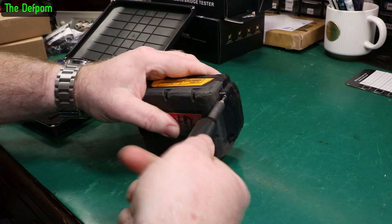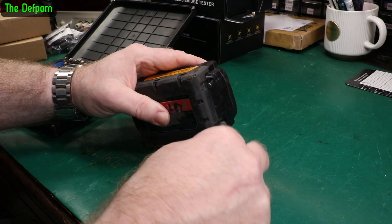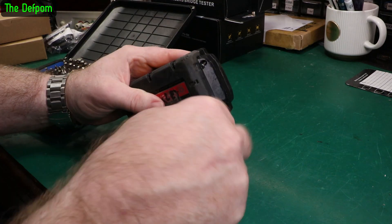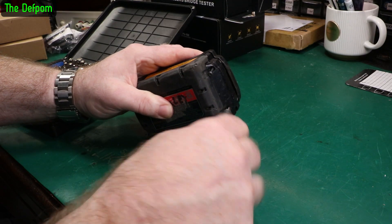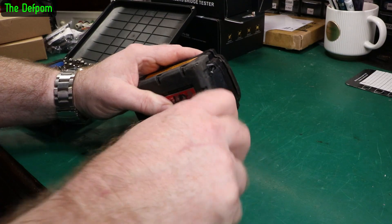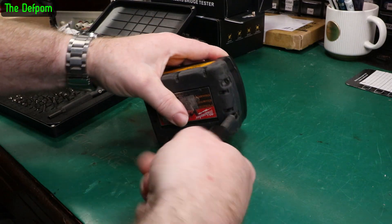When dealing with batteries you have to be careful you don't short things out, because even a faulty battery pack can still have cells which are fully charged. You could very easily make a mistake and short things out, or maybe catch fire. Do keep in mind that even a faulty pack can be dangerous to work on, so just keep your wits about you.